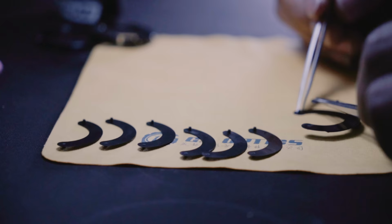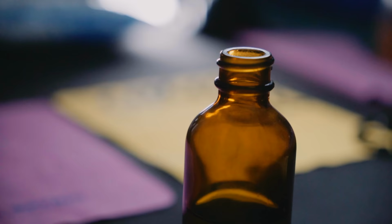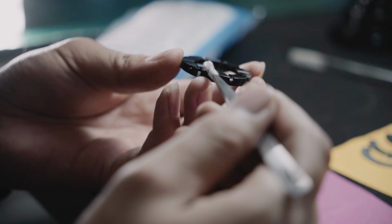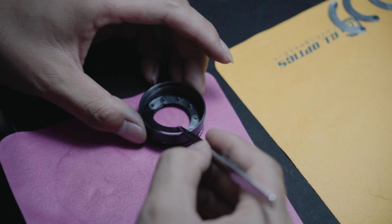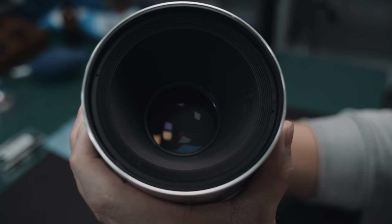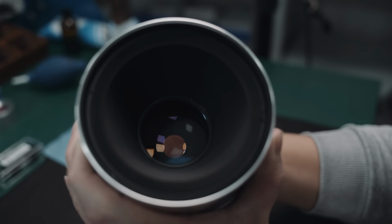As we are going for a faux K35 set using the SSC spherical FD, we naturally opted for the iris replacement. Surprisingly, the new iris comes in parts and has to be assembled by hand, blade for blade. The new iris has 15 curved blades that offer nice round bokeh, just like the iris of the original K35.